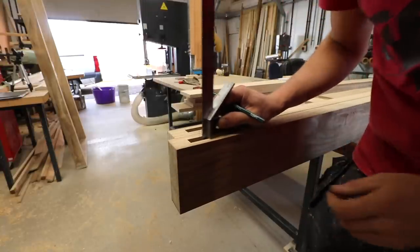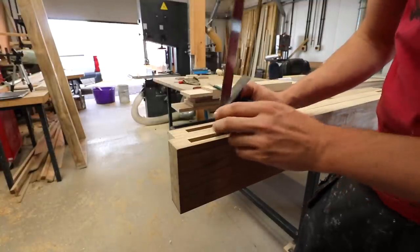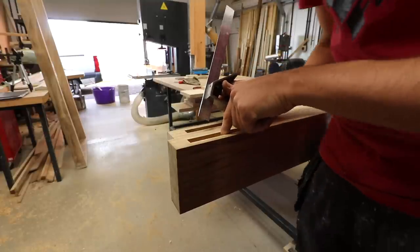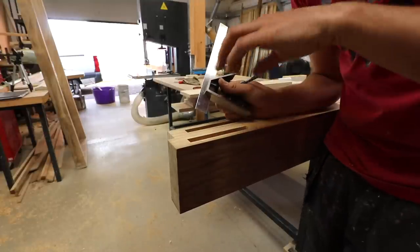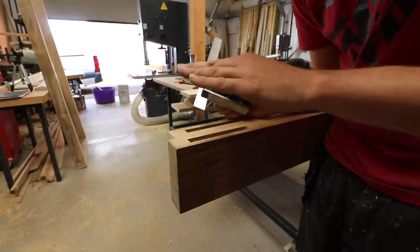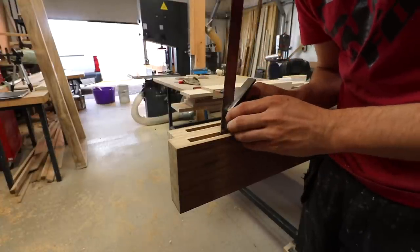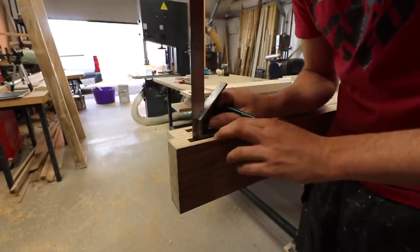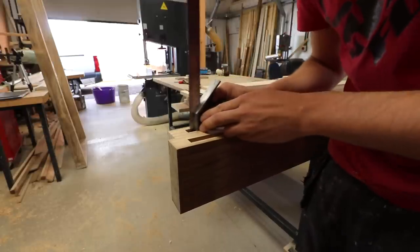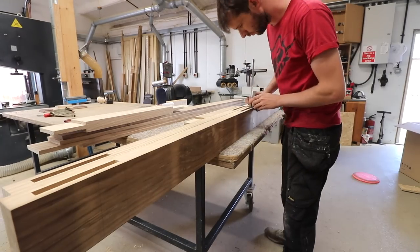If you want a really, really sharp haunch joint, so everything's nice and square, you're going to have to remove the tails from the mortise a bit, so the drill bit leaves a point and a circle cut into the timber. If you want that perfectly square when you look from the top of the door, you're going to have to hand chisel that out or router that out. So you're not going to get a perfect fit without doing that anyway. So having a half mil gap is nothing in the end of the joint in that position. I'll just check all the others.